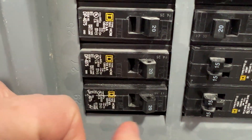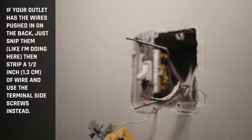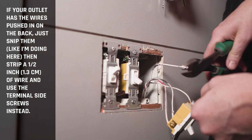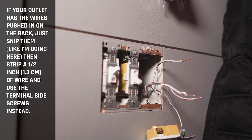For this method, we're going to turn off the power at the circuit breaker box and then disconnect and expose all of the black and red wires that are connected to the two switches in question. From there you'll need to test the current of all wires. To do this, you do need to turn the power back on and make sure that everyone around knows that there are live wires exposed here.